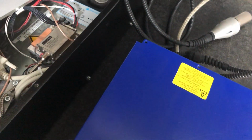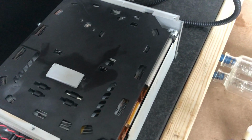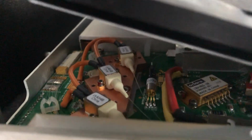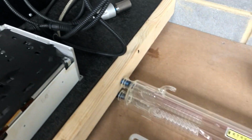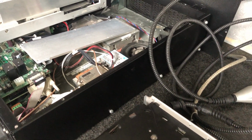Instead of a doped crystal, they're doping the fibre optics. So basically, this is a fibre laser. See inside all the fibre optics, the doped fibres, and in there again you'll have diodes. There we go, you just see them attached up to the fibre optics. Again, different to the CO2s as in the wavelength. So basically these are pretty good for plastics, woods, organic things, and when you jump in decimal points on the wavelength, these are really good for metal marking, some plastics, but yeah, mainly metal.